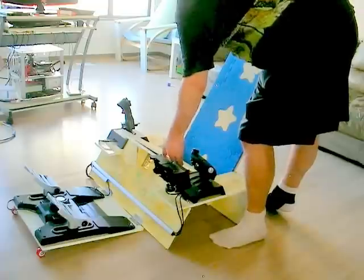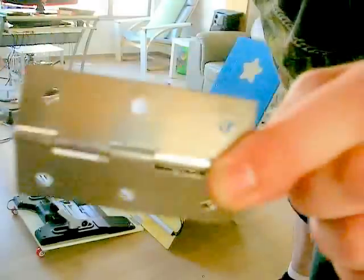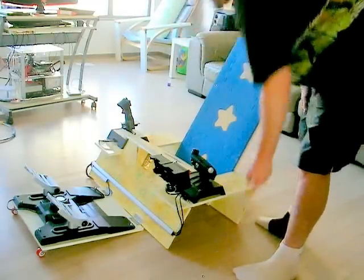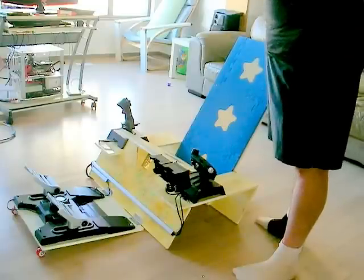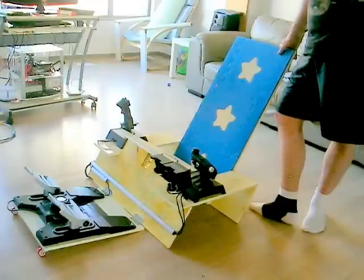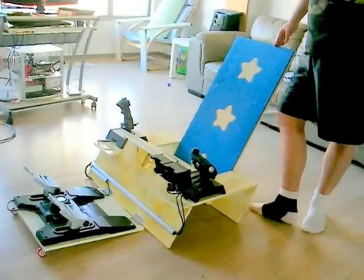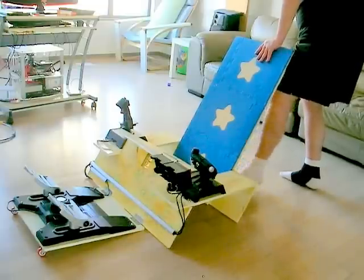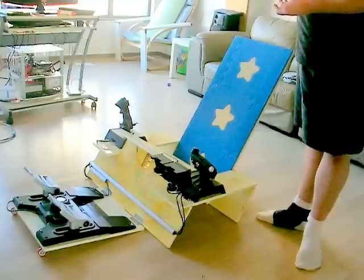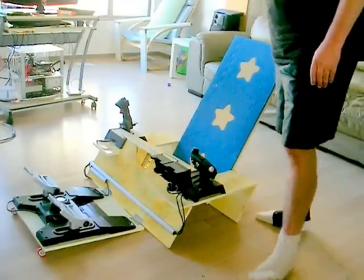Something you might be thinking is: that's half-inch plywood held together with cheap, flimsy hinges. Here's one of the hinges — 2 and 7/8 inches or 72 millimeters. That's a cheap hinge. Clearly I'm over 100 kilos, maybe about 110 kilograms or 230 pounds. The question is, are these triangles going to hold? I was quite worried about this while designing it, which is why I went with mortises and was very careful with the mortises in the back holding that back triangle on. I also mortised the 3-inch casters in the back so they're almost exactly in the same place as the triangle when hitting the floor, including them as part of the support system.